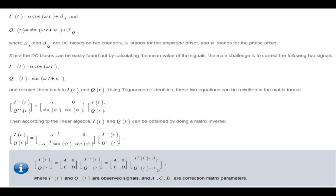I basically took the DATV Express software and added an extra module to talk to the Pluto. I've actually added a hardware abstraction model so that in theory I can add as many different radios as I want in the future. I do intend to add the Lime SDR with the help of Everest. Those of you that have bought a Lime, don't worry, you'll be able to use the software too if you want to. And of course, you can always use GNU Radio if you're a Linux person, or nowadays Windows, as it's possible to get it to run on Windows.